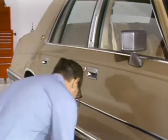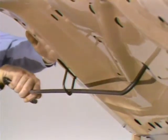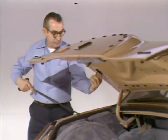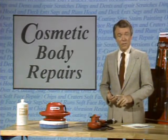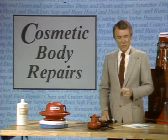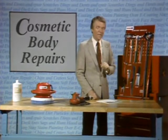It takes practice and experience to know which technique to use on which kinds of dents. When removing dents from the hood or trunk lid using this method, it may be necessary to use a saddle to provide a fulcrum point to get enough pressure under the dented area. This is included as part of the toolkit. As you can see, this area looks as if it had never been dented. The original high-quality finish has been preserved and the whole job took minutes, as opposed to the day or more it would have taken to drill, pull, fill, and paint this same area. It's not difficult to do, but it does take practice to develop the feel, as with any art. And it's important to take proper care of your tools, checking and maintaining them daily like any good craftsman.